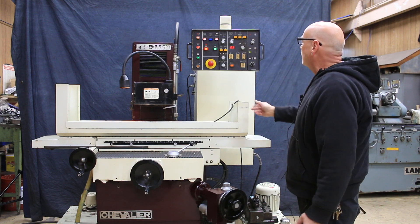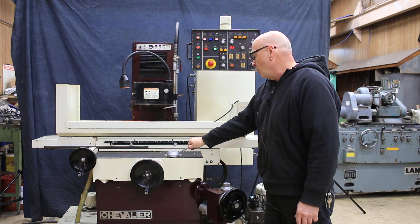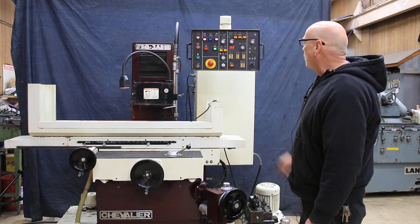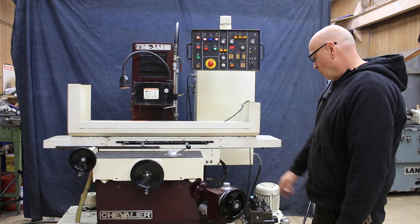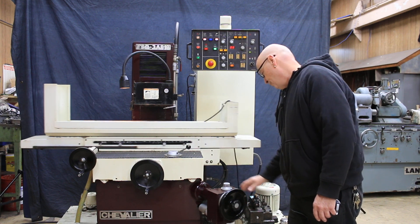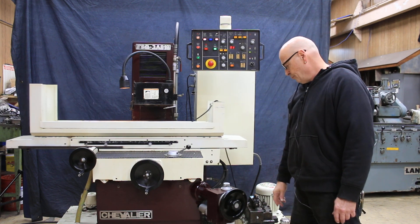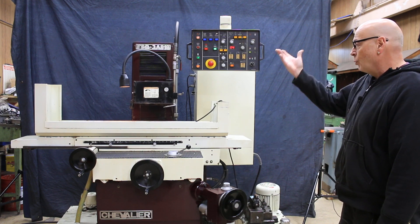This also has a slot grinding or plunge grinding mode. As soon as we switch from one mode to the other, we get our light blinking. When I start this up, we won't have any cross-feed, but every time it reverses, we do three feed pulses — I could change this to four. This will work its way down to zero, and when that light comes on, we're at zero. Now we do our empty spark-out passes, and then we retract back up.